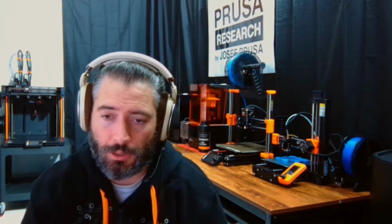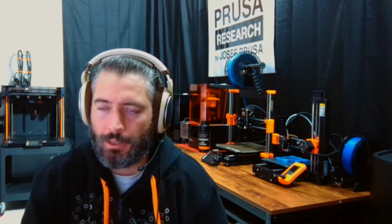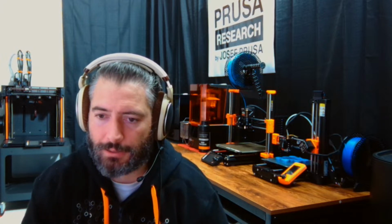As long as you've built the frame and it's not askew within a certain tolerance, but the software will actually tell you. Of the 8 that I built, one of them was slightly off, and I got that alert, and it didn't feel that wobbly on my table. It didn't feel that far off. But when it checked, it told me, hey, this is outside of the tolerance of the sensor you're using, and it needs to be changed. So I just loosened all the bolts, found a better place on the table to press down and flatten it.